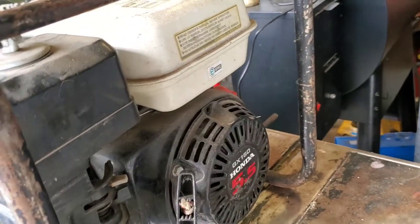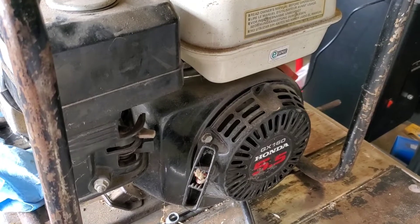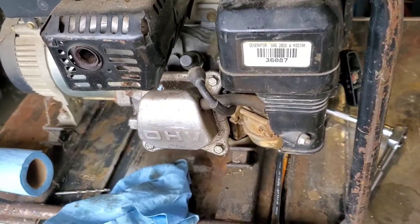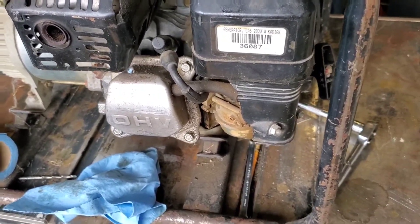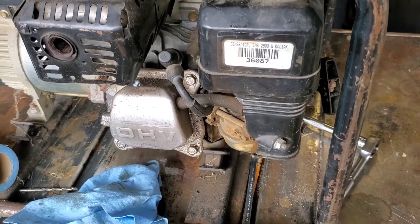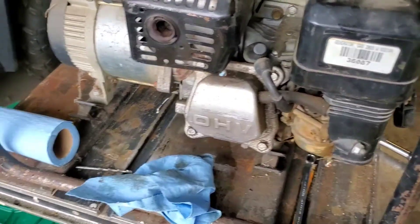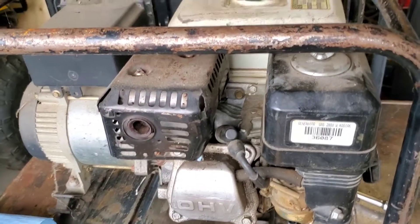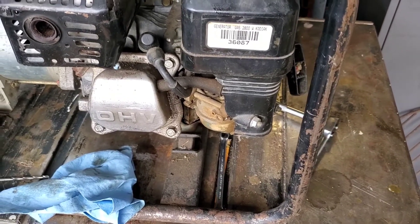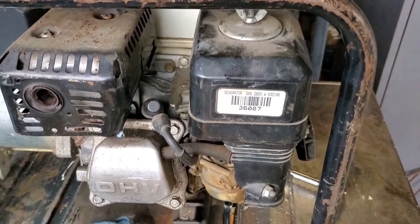That would have done our lighting and our air compressor — we had a small air compressor, which is now down in the gun shop. So if you come across an older piece of equipment, my recommendations are: pull the spark plug right away before you start jerking on it. Give it a shot of oil in the cylinder so the rings are lubricated — it'll help them unstick faster because lubrication will come from the top and bottom. The sooner it unsticks, the less chance of damage to the cylinder and piston. Pull it over lots to get some splash going on — these are splash lubricated.